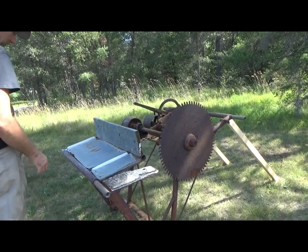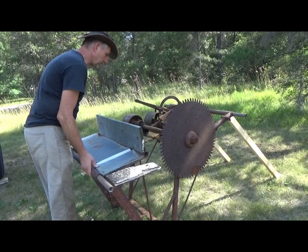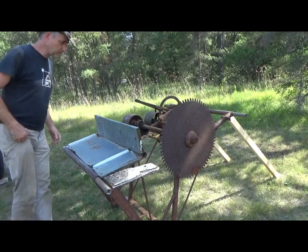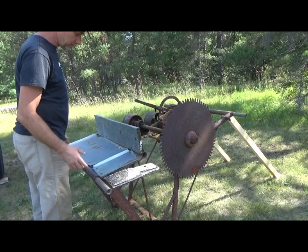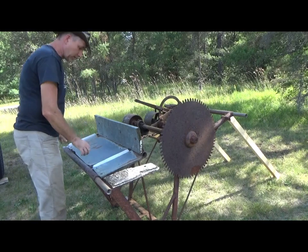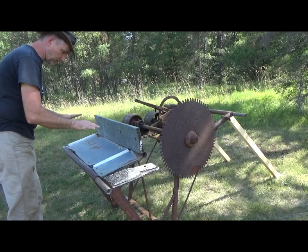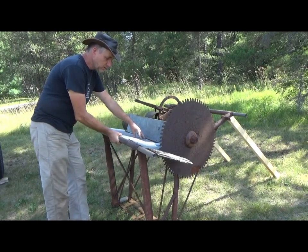This is a buzz saw, also known as a cordwood saw. I think I mentioned that earlier. Now I hope I don't wreck my tension on that. So what you got here, it's gonna have to be higher for me to be comfortable. I'm gonna have to build a deck for that and put it on wheels so that I can move it around, because this is heavy. I'd like to be able to move it around as needed, but you got some rollers which still work. I'm gonna have to oil everything up, and you put your log on here and you slide it over, and you can put a stake in the ground. You slide it over and it's set to 16 inches, and then, you know, imagine this is up to a little bit higher, and then you simply hold your log and run your table into your buzzsaw, cutting your firewood.